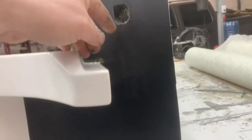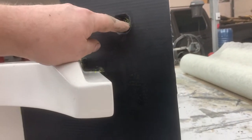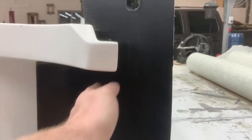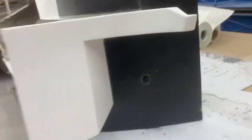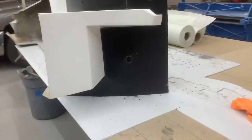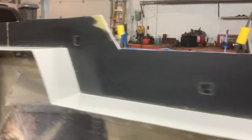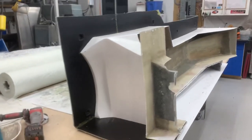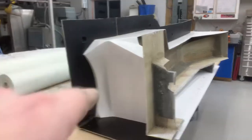We don't want to get behind there and create a lock. I can feel a shelf there, so I need to file a bit more off. The mold will have to come out in a specific order — the first section to come off will more than likely be this end. I've got to file this out a little bit because that angle isn't quite right. We don't want a lock again. I hate to make a part and find I can't get it out of the mold.